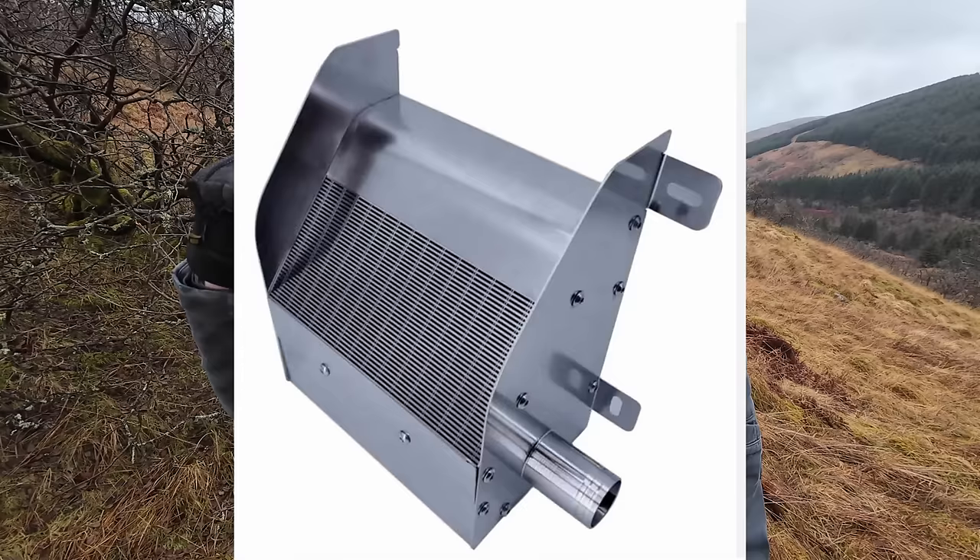When people mention 3D printing a Coanda screen — if it's stainless steel it's smooth, so water flows nicely over it. What a Coanda screen is: it's lots of grilles layered on top of each other like a ramp; the stream flows over the surface and water falls into a collection chamber at the bottom. Because the flow washes over the filter surface, it sweeps away debris so leaves don't clog the intake. If it's 3D printed with a traditional printer, it has rough layer lines, which would cause stuff to stick. Laser sintering printers are far more expensive and don't print large enough — so for now it's just too much money.